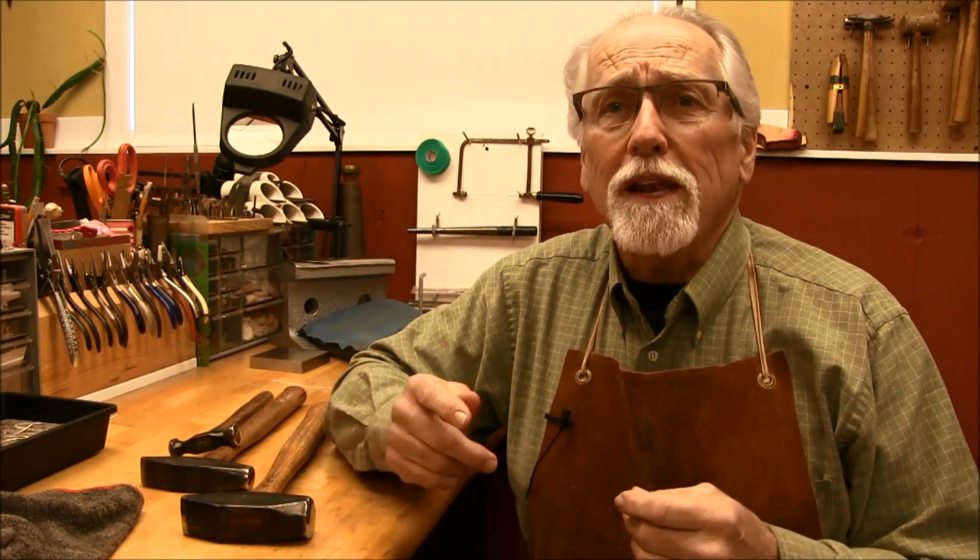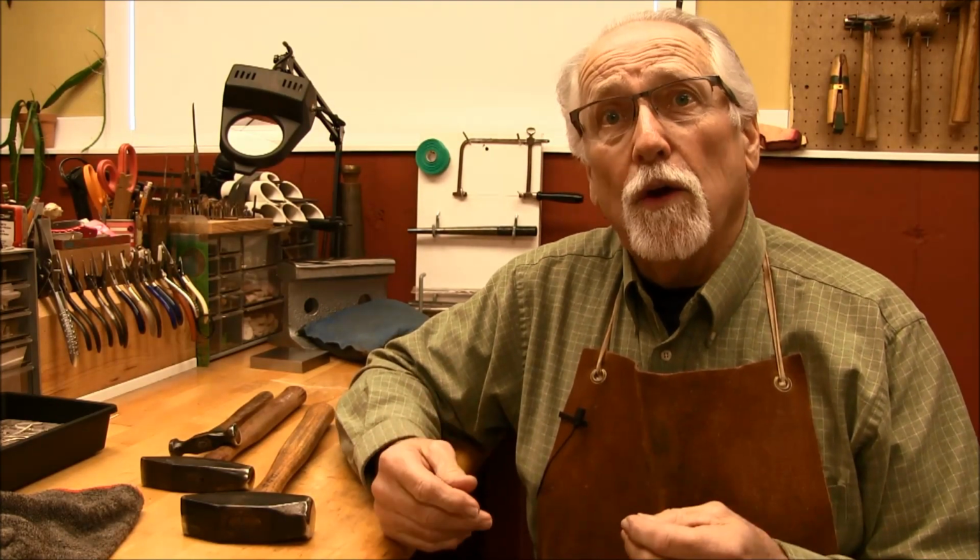This video will go into a little bit more detail about forging sterling silver wires, the styles of hammers that we'll be using for forging, and also what we can do with these wires, taking them from boring, square, and round wires to more three-dimensional forms with much more visual interest. We'll be forging these wires flat, forging them to a single reverse, a double reverse, and multiple reverses. Also, I'll be showing you examples of jewelry using these types of reverses so you can see how the forged wires are integrated into a jewelry design. We're going to have lots of fun doing this, so why don't we get started?